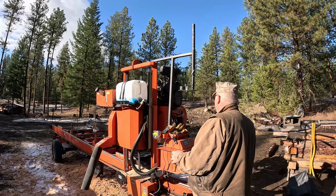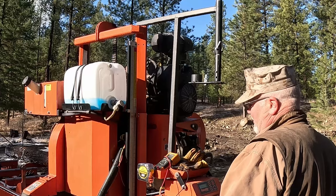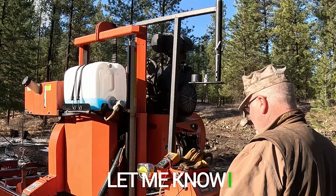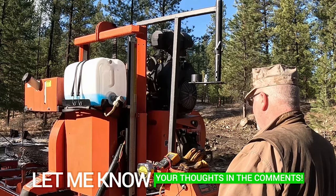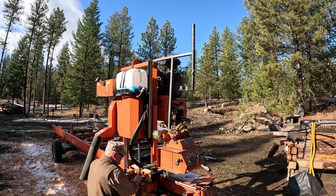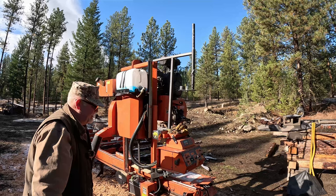Oops. Uh-oh, folks. Okay. That's a bad sign, folks. I got power, but it's running slow. Well, we're at 11.85. So folks, we're getting a drain here, but now I need to see if I can fire it up and get it running and see if it'll start.